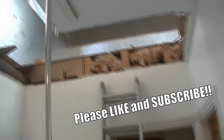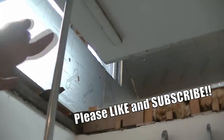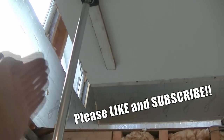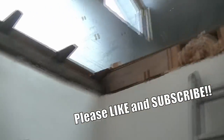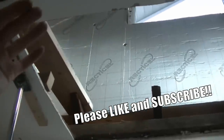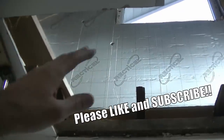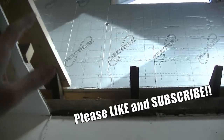Just to show you what we've done so far — we've cut the ceiling out in our L-shape. It's a bit rough and we'll tidy up the edges later. What we've been doing is removing the plasterboard first, bringing that down, and then we'll go through the lath and cut that away. We gave it a good hoover with the Henry beforehand to minimise the dust, and then gone over it again down here.